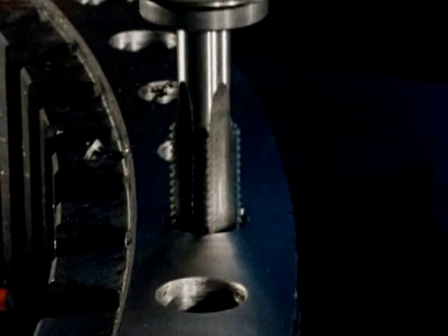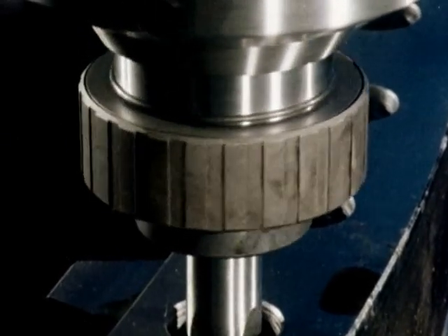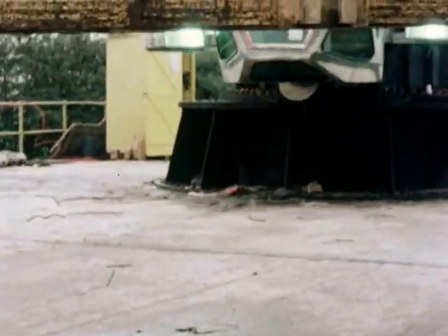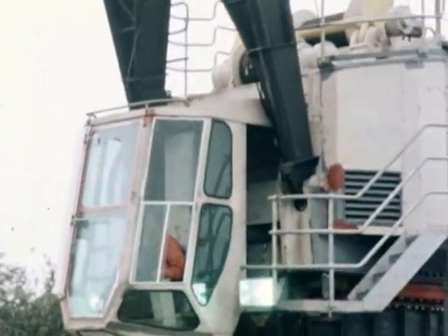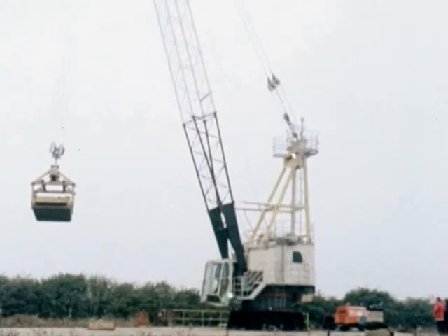This is one of the most vital parts of the revolutionary Sea Lion Crane developed for use on offshore oil rigs. Dormer taps are used in an SPV tapping attachment to tap retaining holes in the slewing ring of this new fast lift crane. Unlike conventional cranes, the Sea Lion has no counterweight or balancing system. This slewing ring and the bolts securing it are withstanding the full strain of the crane's boom and the 60 tonne load.